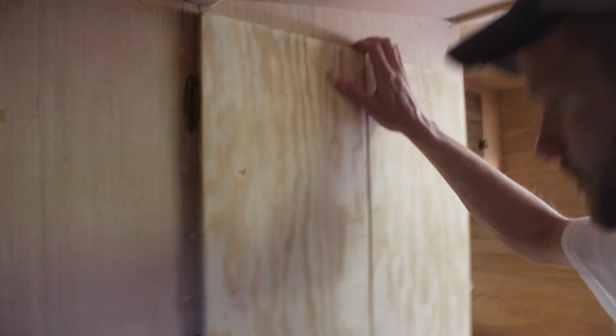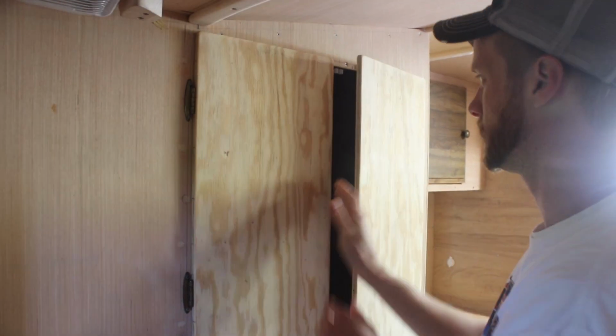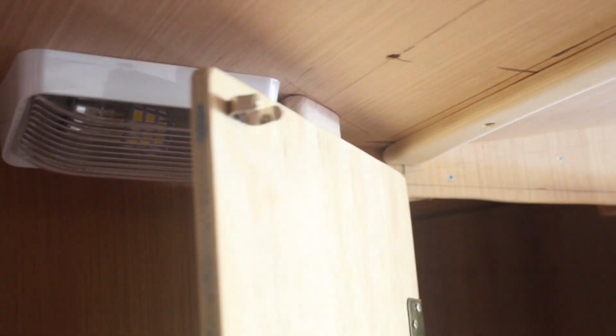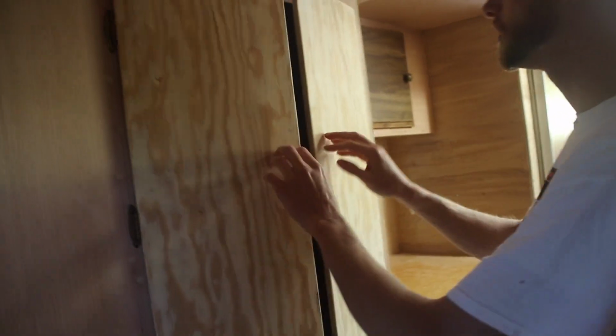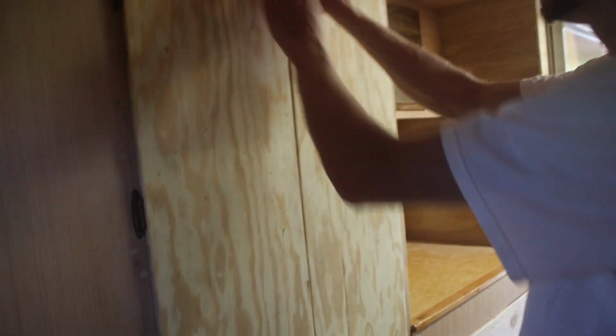This is the one that I did last here. And I don't have handles on these yet, but just do your best. So this was hitting the light. I installed this piece of oak actually just to hit it here, and I'll put some felt there just so that it doesn't hit the light. And then also, so these are the half-inch plywood, and I didn't know how to do this because I didn't want a center divider in here, but then I was also nervous that these would flex too much, but it's not bad. For half-inch plywood, it's not bad.